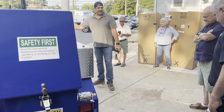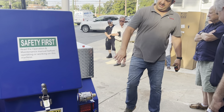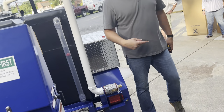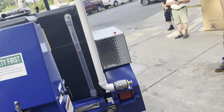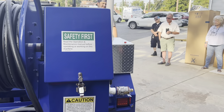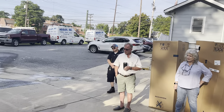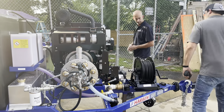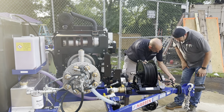You've got your visual sight tank — that's new. You've got your hose fill. If you do work for a municipality or need the 2-inch connection, you just do it here. Toolboxes with keys. We ask that you do your first service at 500 hours — go ahead and do the pump and the engine at the exact same time. On your engine you've got all your key codes for all your filters. Your 7-pin is already built in.